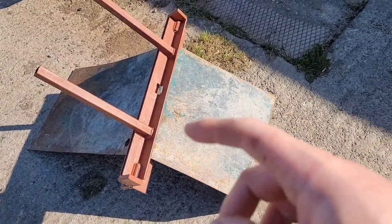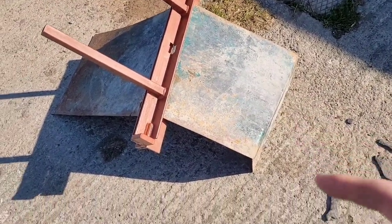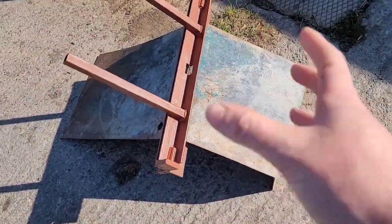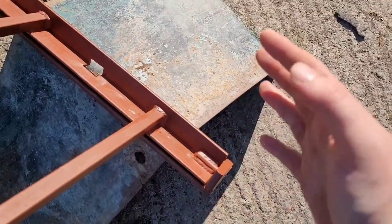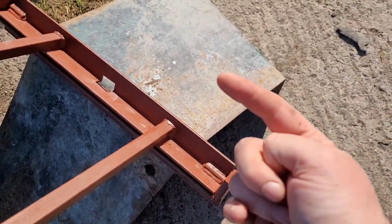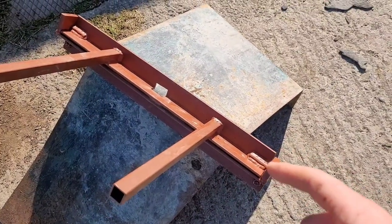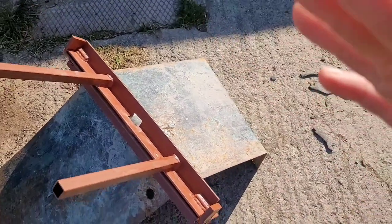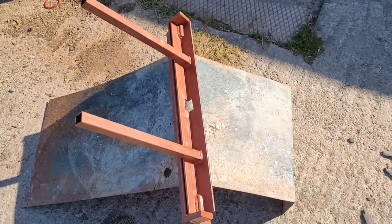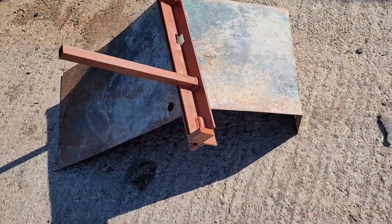So I said there was only small bits of oil tank I'd be doing, but I thought I'd try it out on the little tray I was making. It's tapered so it goes wider. Only thing, because I've done it to 90, it won't actually bend to 90. You need to go over 90 to get it to hold, so this won't actually do it to 90, but I didn't get anywhere near it anyway. It's going to make the side fold like that, so it's a bit wider again. I wasn't going to do it actually 90, but it was very close anyway.